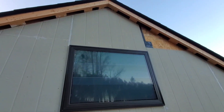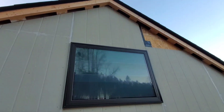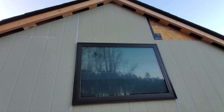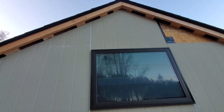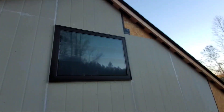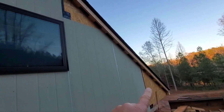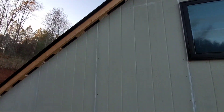Believe it or not, this roof angle and the other one are just a little bit off. It's not much, but it is off — that's just the way houses are. They're not 100% straight; that's the nature of wood. You can take those extra cut pieces and use them for a pattern as you go down one side, and then do the same with the other side.